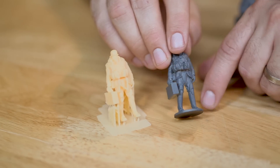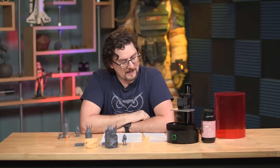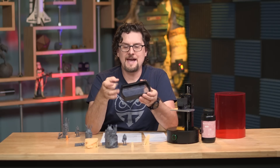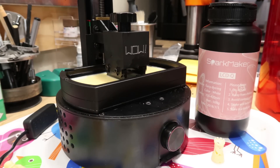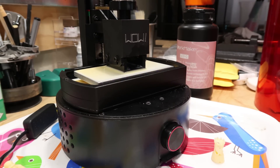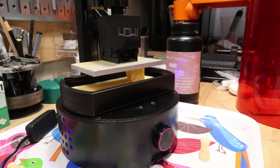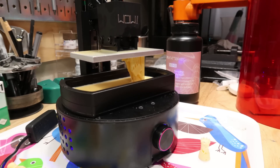The good: decent software — I was pleasantly surprised. It gave you a fair amount of control over all the details of your print. The linear rail and hardware feel solid, the build plate didn't move around much, and the metal vats are a welcome upgrade from the old plastic ones on version one. Prints turned out great — no print failures, and the detail was really impressive. I also liked that extra tanks are available for different resins, since you want a dedicated tank per resin rather than trying to clean one out every time. The FEP film is replaceable and they'll be selling replacement sheets on their website.